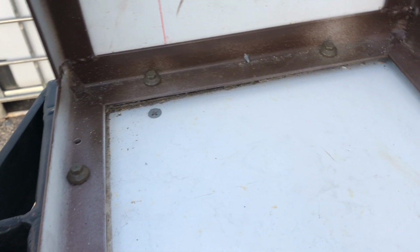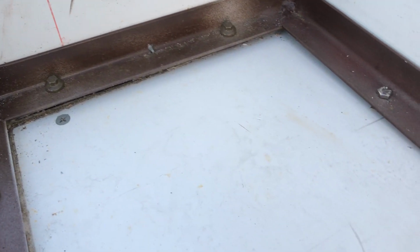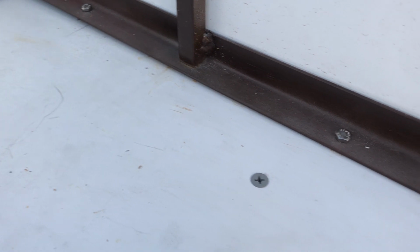The box frames are attached to the flatbed in 2 different ways. First, we used metal to metal self-tapping screws to attach them directly to the flatbed frame. Then we use stainless steel self-locking nuts and bolts to go through the PVC and plywood base.